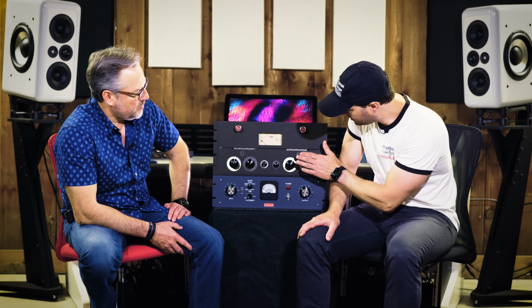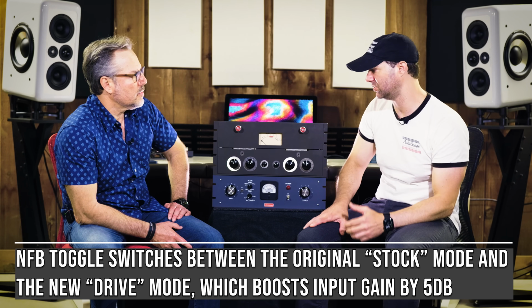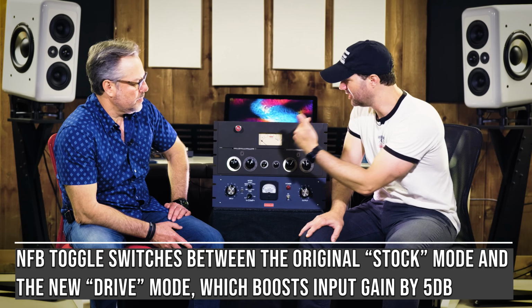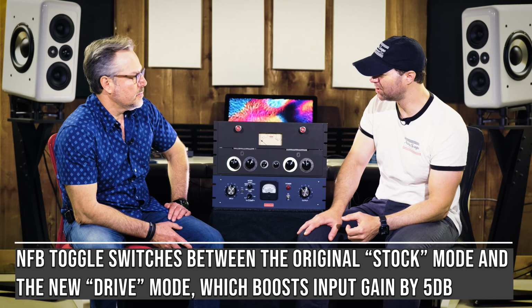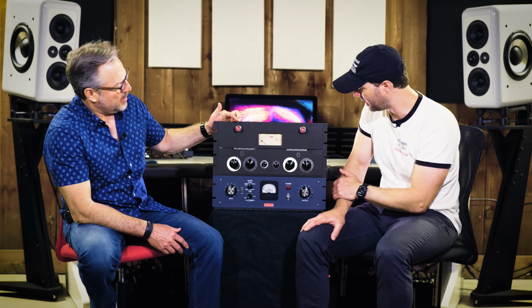You can hear that sound of the amp itself. And another cool thing we added was the negative feedback switch, which reduces the negative feedback, adds edge, harmonics. Think of it like supercharging the gain reduction section. So it's going to compress more. It's going to get a little bit more distortion, but there's something really pleasing about it. It's almost like cranking the input, turning down the output, and getting more saturation. Interesting. In use, that's what it's like. From an end user side, I guess that's the best way I can describe that.